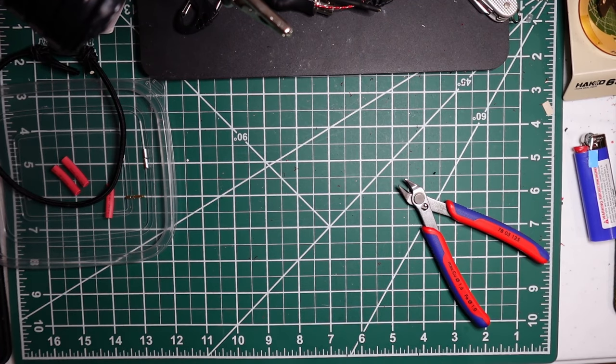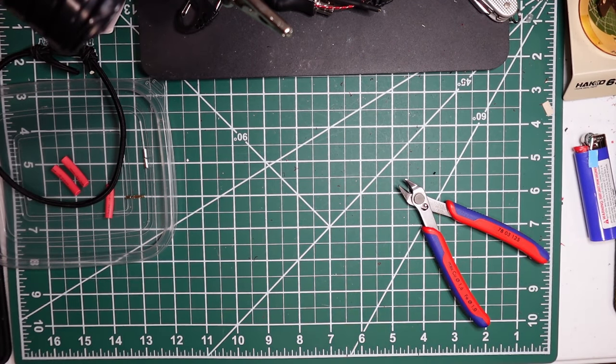And I've got to look at what I'm supposed to be making here. I got a 35 foot. So for the 9-to-1 with essentially a 2-inch loop on one side and then a 2-inch loop and a 5-inch tail, what I found works well is to cut these length plus 9 inches. So I think I said 35 foot, so that means we're 35 and 9 inches.